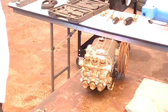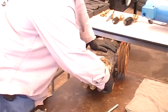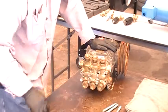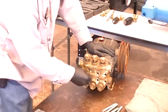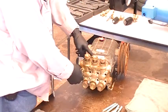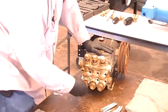On this chart also I have the foot-pounds to tighten up everything. This is what we call the wet end of the pump. When you go to order parts, the best thing to do is to have the type of pump and the model of the pump. If you don't have that, I suggest bringing in the whole head — we can always match seals to it.